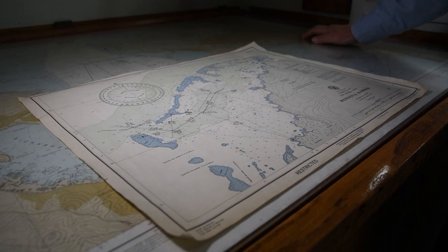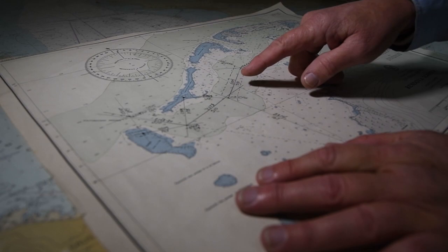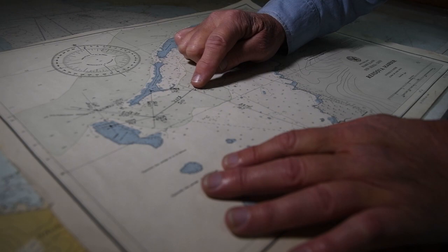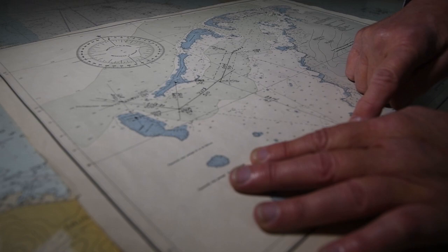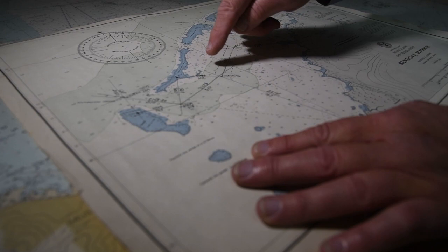Back in the warmth of the chart house, looking again at our World War II chart of Rendova Harbor, we can see several fixed positions taken by a ship entering the harbor using the same strategy we discussed out on the bridge wing. For example, at 0314 in the morning, a fixed position was taken by sighting a white beacon on one side of the harbor and a beacon on the other side. The bridge wing compass repeater was used to determine those two bearings, then back in the chart house they drew the two lines and got a fixed position.